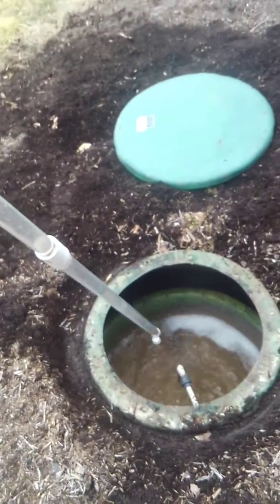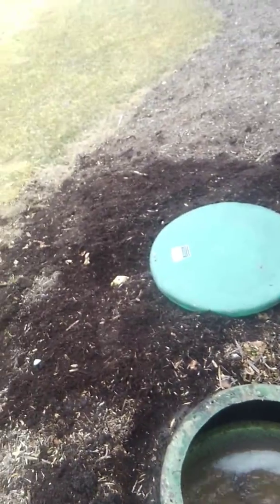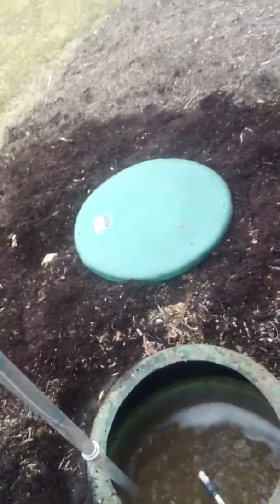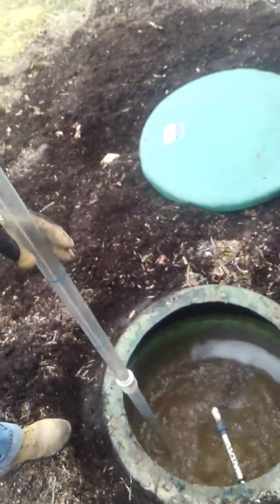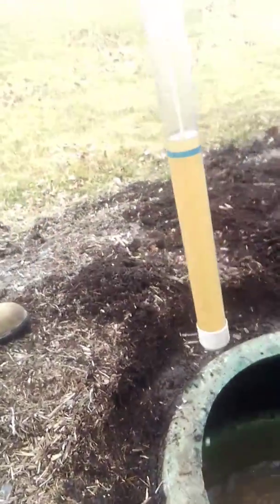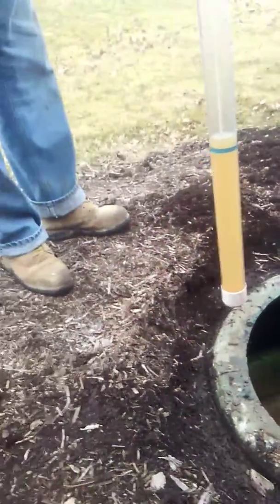I just released my sample and now I'm going to grab a quick sample. I dip it down, take a sample, pull it back up, release the plug, and pull it out. So we just grabbed a quick one-foot sample and you can see the color of it. If we let this settle out, this particular one would again have about 40 to 50 percent solids.